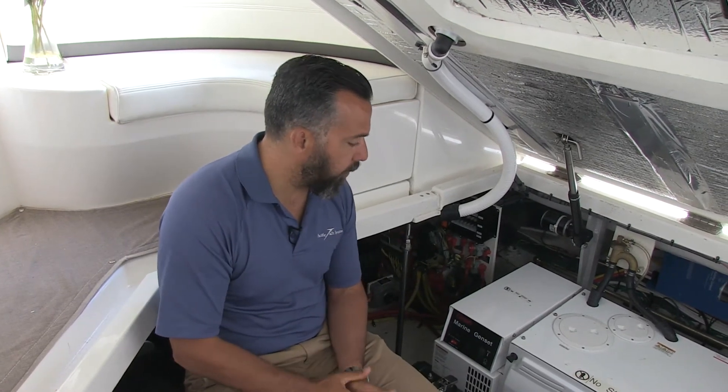You'd just be realizing that a fuse may have blown downstream. So it's really essential when doing a battery monitor to go directly to the battery for voltage sense — and that's basically what we did in this engine room.